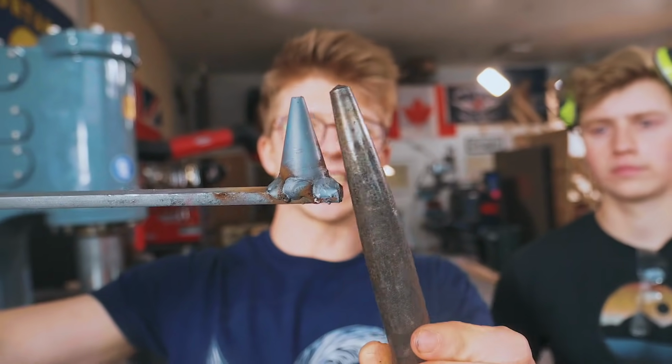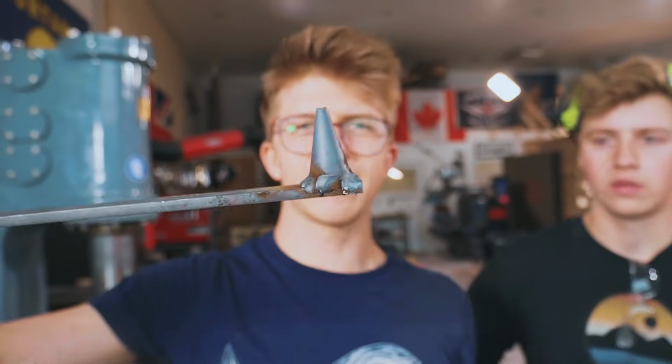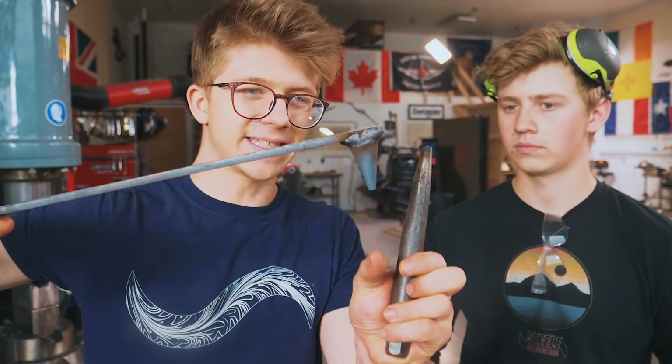You look at a punch like this, this has a much less obtuse taper. This is a much shallower taper. The reason for this is under the power hammer, inevitably, we're putting a lot of force in there and probably gonna strike more than once. This can get stuck, and so I wanna use the self-releasing properties of that aggressive taper to help pull that out of the hole nice and easily without that getting stuck quite so easily.